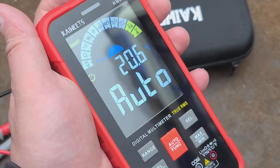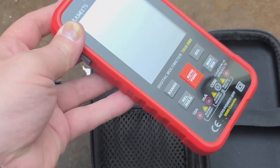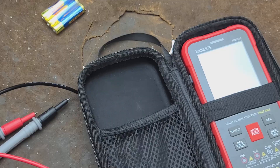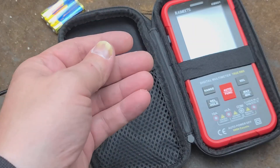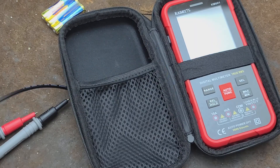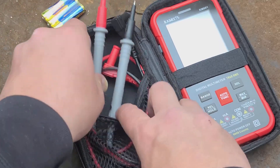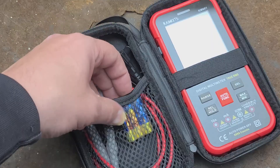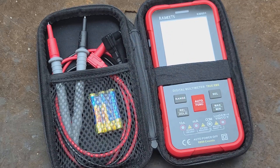As I was saying in that last Kaiweets video, you're getting so much for so little money because of those cheap chips. The resistance will do up to a hundred million ohms, which is huge — you used to have to buy a special dedicated resistance meter to make a reading of a hundred million ohms. If you grab the probes between your fingers, it can drop to a few hundred thousand ohms. Thirty years ago a meter with these stats would have been a few hundred bucks. Inflation is not linear across all product categories — nowadays you get exponentially more value for your dollar on something like this, which you can find for 30 bucks, or even 10 to 20 on eBay.